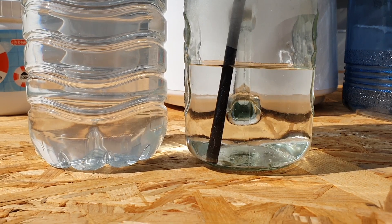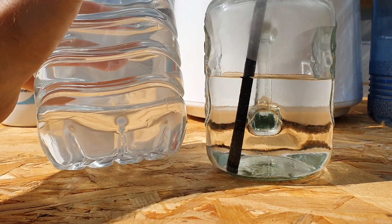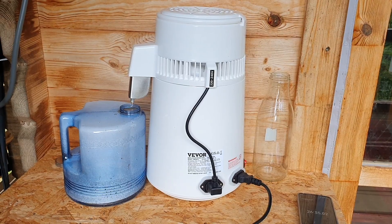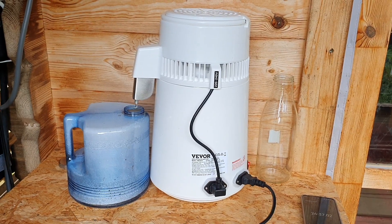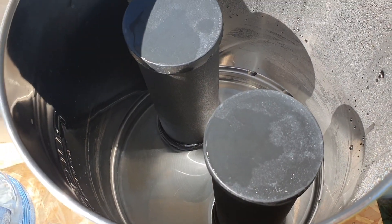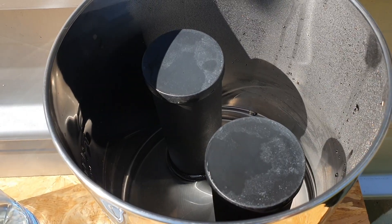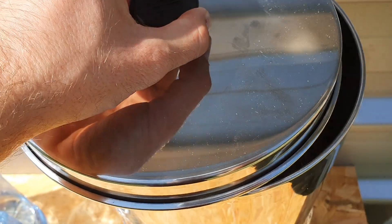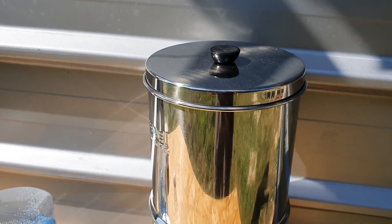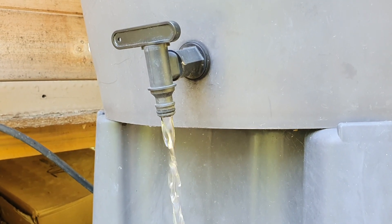If you're willing to put in the time, you can cut down on your water bill a lot by harvesting water that lands on your roof or water you might have on your property. You might find that just distilling the water with the small carbon filter is enough, or that a gravity filter system is enough. I've also researched reverse osmosis — it is an effective way to filter water, but it does use quite a lot of water in the process. If you're conserving every drop like with rainwater, you might not want to go for a reverse osmosis system.